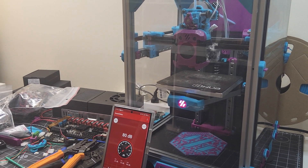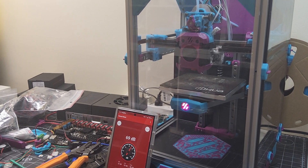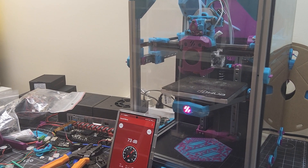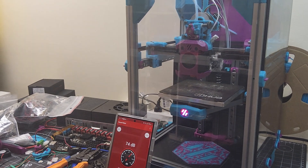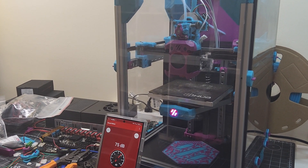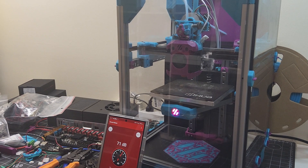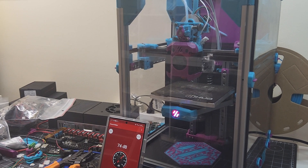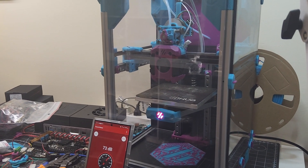I'm going to go ahead and leave the Honey Badger fans in the tool head for now and see if the heat creep clogs I think are happening are a thing of the past with the more powerful Honey Badger fans. I don't have a lot of fancy scientific equipment for proper airflow measurements, but I may try to put the different fan brands through some testing on my workbench and record the results. These Honey Badger fans are expected to do better for part cooling and hot end cooling specifically — more news as it happens. Thanks for watching, that's it for now.